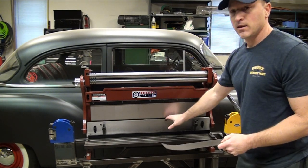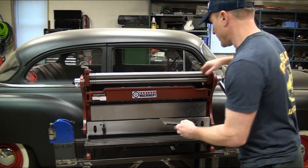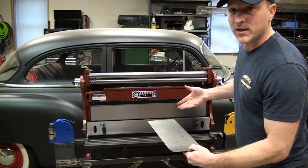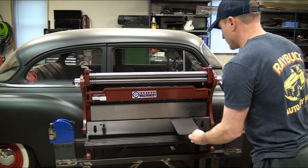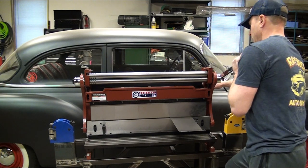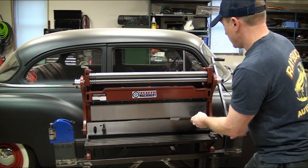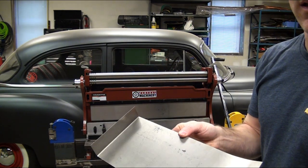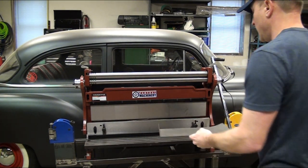The last piece is the finger break. I'm going to put the steel in. Normally I'd have a line marked if I were making something a specific size, but for this demonstration I'm not going to worry about it. I'll put it in, lift up on it, bring it down, take it out — and there's my piece, there's my angle. You can see how it bent like that. Like I said, not a whole lot to it. Pretty easy.